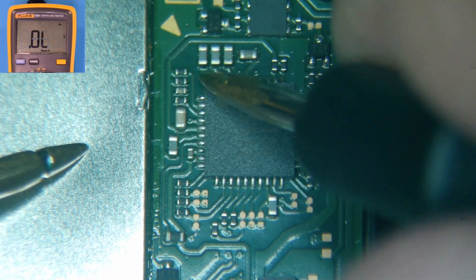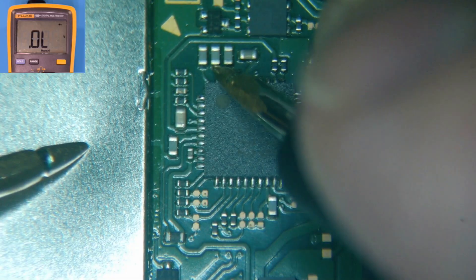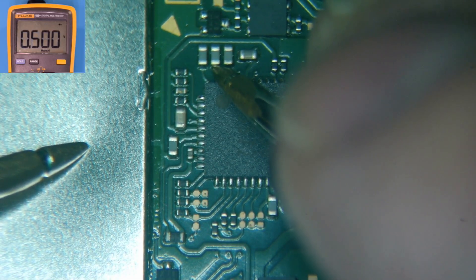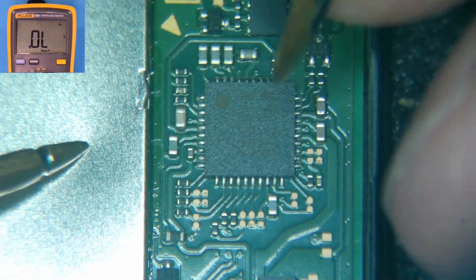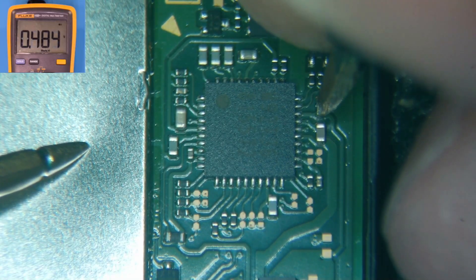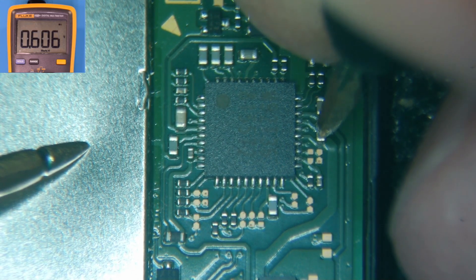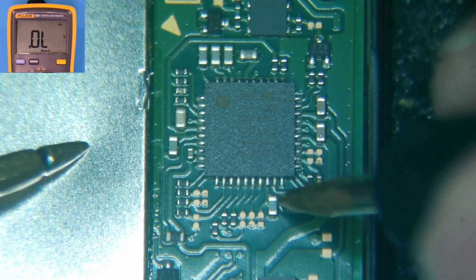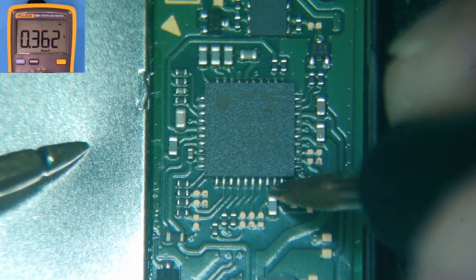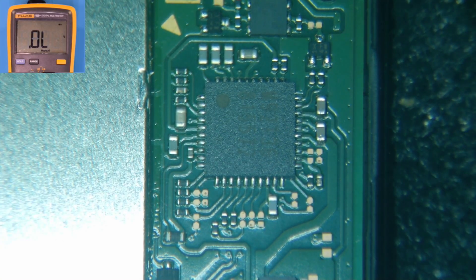This one is 459 — good. Over here we've got 344, about 500 or so. This is 344, and then this side we're going to have 485. On this one we've got 0.6, and that is kind of scary, because the last cap that we checked for this charging IC is right here — and fortunately we have 0.362.